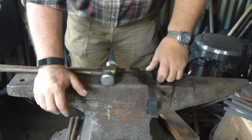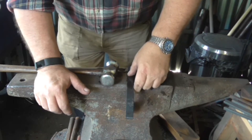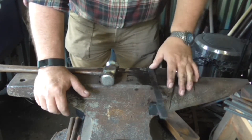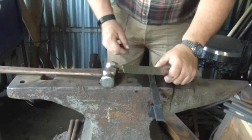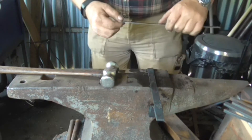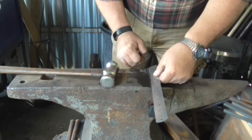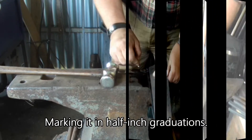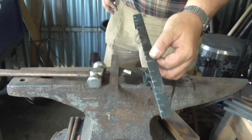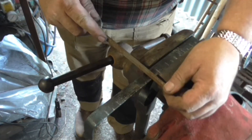Not brilliant, but is it stable? Not that stable. I wonder why that is — maybe it's because it's not wide enough. I think it'll do the job for measuring purposes. Now I'm going to have to mark graduations on the face of it. In the video, the first mark you want to be exactly level with the edge of your angle — that's like zero there. Now I'm going to have to file in marks on those measures so it'll be permanent. I think DF in the Shop used a triangular file for this, but I can't find mine, so I'm going to use a square one instead.